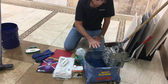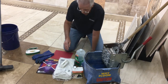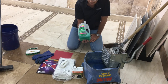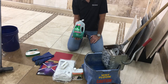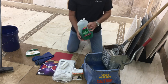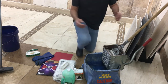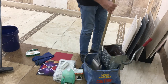When you buy a natural stone floor, you're going to want to get a mop bucket with a wringer as you see here. Some of the other things you're going to need is pH balanced soap. Amazingly, regular old dish soap is pH balanced. However, if you buy stone soap, there are water expanders in there that reduce spotting if you wish to go to that step. It doesn't take a lot of soap, just a little squirt to get started. You don't want a lot of soap because soap causes spots.